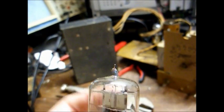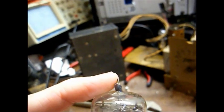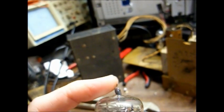Next, we will prepare the lead coming out of the tube for soldering. To do that, we'll take a fine grade of sandpaper and sand this down a little bit. Also, I can tell you that this lead is not long enough to protrude through the hole on the top of the tube cap, so we will have to solder a short piece of wire onto this.